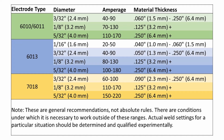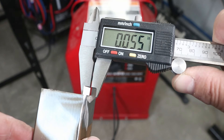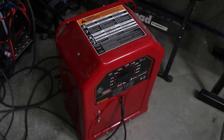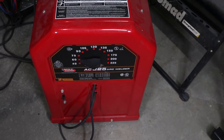We're welding square tubing with a 60 thousandths of an inch thick wall. To weld that, I'm going to select an electrode I can run at pretty low amperage — a 6013 electrode, 3/32 of an inch or 2.4 millimeter. That lets me run clear down to about 40 amps. It's pretty difficult to keep the electrode lit at 40 amps, so I'm going to run right around 60.